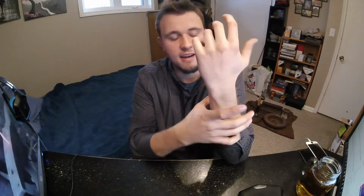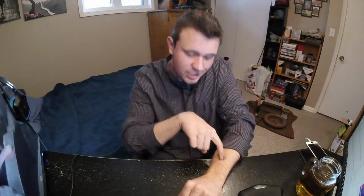Another thing that is important as well, if you're wearing gloves that have an open cuff, I like wearing a long sleeve shirt even though it's hot working in the forge, because there are bits of slag that can fly off material that will go into your glove and they will stick to you and they will burn you, and it's like the most disgusting smell you've ever smelt. You know, your own flesh burning.